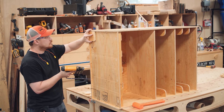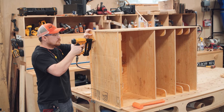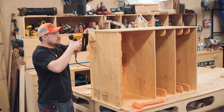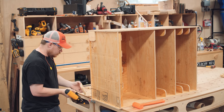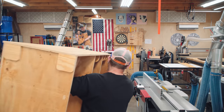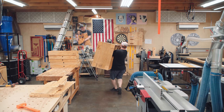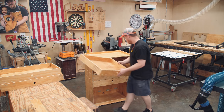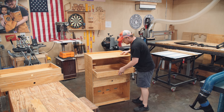The plywood is only half an inch thick — specifically 0.47 inches — so I added blocks to the bottom where the casters go. This doubled-up thickness of plywood will give enough material to use one-inch washer head screws to attach the casters. I was still awaiting the casters that day, so I went ahead and tested out the drawers. The drawer fronts are actually the drawer stops — they extend half an inch below the drawer bottom and hit the drawer runners when the drawer is pushed all the way closed.